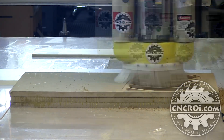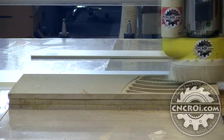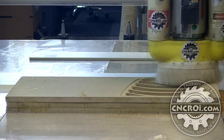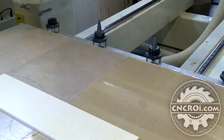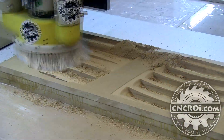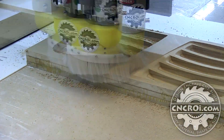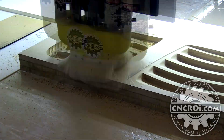They're still sorting out whether a positive or negative mold works best, which is why we're doing both on one sheet. With MDF you generally can't get the thickness you require, which is why lamination is needed. Different materials have different available thicknesses — acrylic can come one inch thick, Dibond is maybe quarter inch — so there are different glues and applications needed to build up the required thickness. I also have a side business making custom woodworking projects at sandboxranch.com, where I do glue-ups using solid wood cut to size on this same machine.